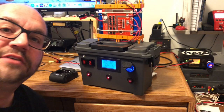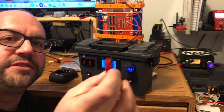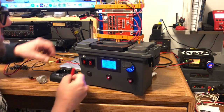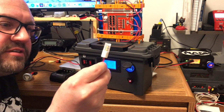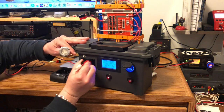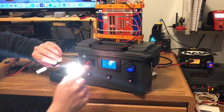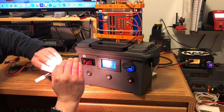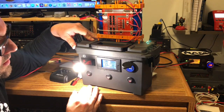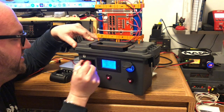I almost forgot the coolest part. I had these 12-volt LEDs — I stuck them in the wire and power-poled them, of course. If the power goes out — I'm a flashlight geek with 800 million flashlights — but who's got a G4 LED like this? This one here is really more of a spotlight, drawing 0.54 amps and 6.7 watts. This other one draws less: just 1.8 watts at 0.14 amps, and it actually fills up the room more because the LEDs are all around.